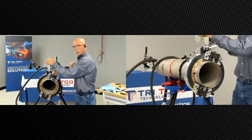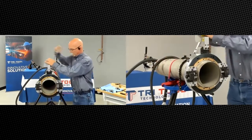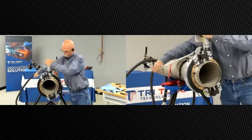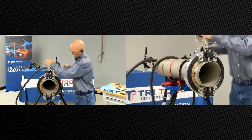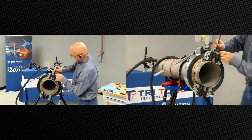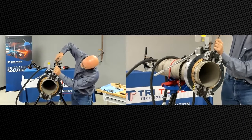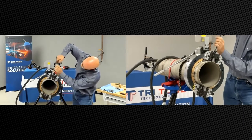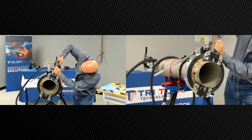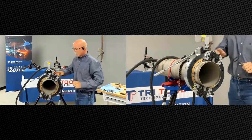Next, take your bevel bit or trailing bit — whether you're sever-beveling or straight severing — and put it in the same location. This will be a trailing bit, and you want to have it a half a turn behind the leading bit. So bring it back one, two, three, and then a half, then take out the backlash and time that star wheel again.